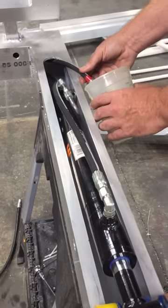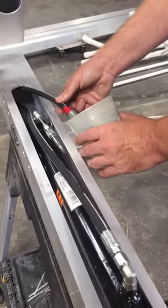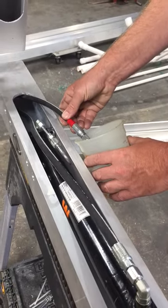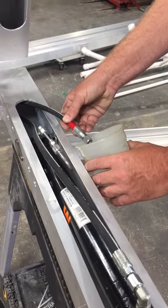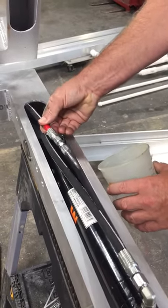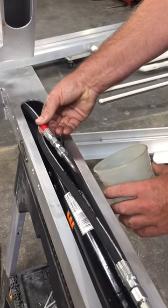The operator is going to have to hit the switch for just a couple seconds. There will be fluid coming out, and when that fluid comes out constant and clear for a second, you know you're done. You will take this hose, connect it, and tighten it up. You're done bleeding that line.